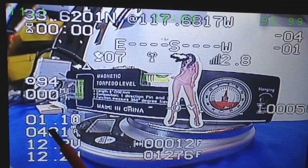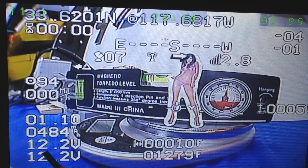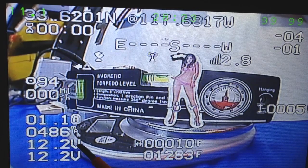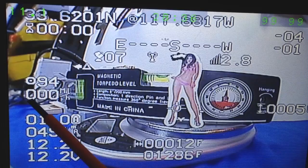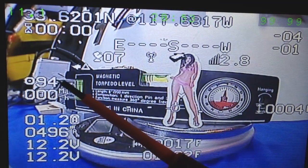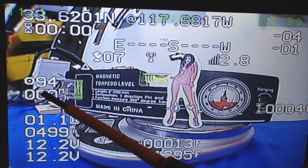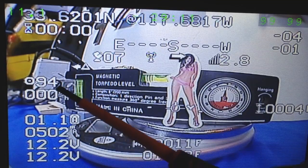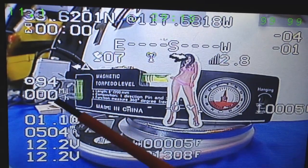Battery voltage information is in the bottom left-hand corner. These are the current amps you're pulling right now, and these are the total milliamps you've used — all these parameters can be dialed in through the OSD. These two numbers are the voltage of your flight battery and your video battery; I have both tied into the same battery so they read the same. This is your speed in miles per hour, which you can also set to kilometers. This number — currently 94 — is a vibration indicator. If you have an unbalanced prop, this number will drop to around 50 while flying. You want to aim for 65 and above, because if the flight controller is getting vibrated too much by the motor, it may not react properly.